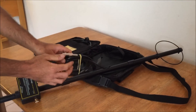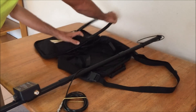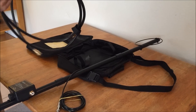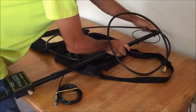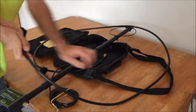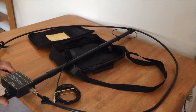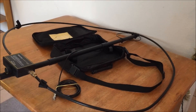This connector goes to your radio, and that's why I mentioned the BNC to SO-239 adapter. The loop is actually made out of this piece of coax — it looks like RG-8 or LMR-400 with ends on it. Basically, this is your loop. There's a round piece on top that goes right on the top of the assembly. You stretch the pieces out — don't kink or bend them — just manipulate them into the bottom piece. There's one, there's two. The loop is constructed. It's that simple.